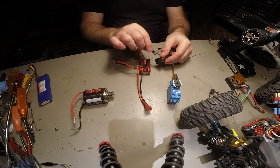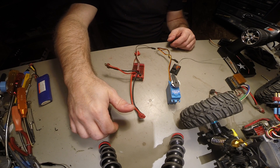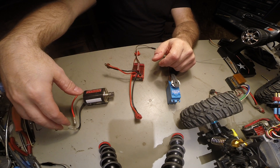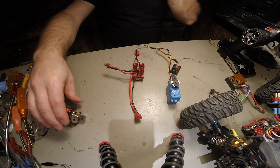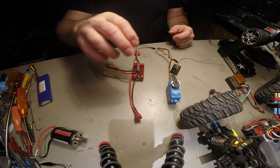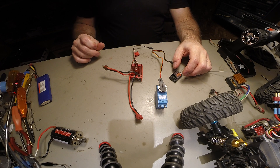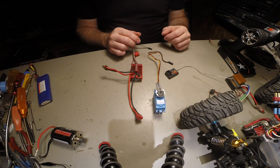Second, check your connections. Make sure your motor is properly connected, your servo connectors are properly in, and your ESC is connected on the proper channels. If your motor is not moving at all but the light comes on to indicate you're getting a signal from the radio, check the connections from the ESC to the motor. If that doesn't solve the problem, try a different motor — it could be that the motor is burnt. If your servo is not turning, try it on a different channel on your radio. If it still doesn't move, and you know that channel is good because your ESC works on it, then you probably need a new servo.